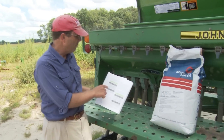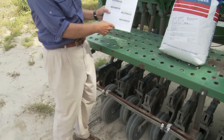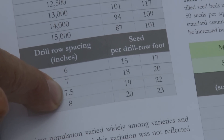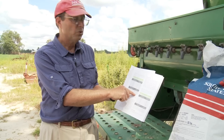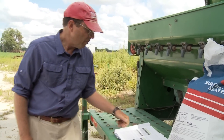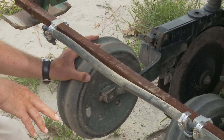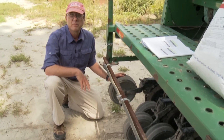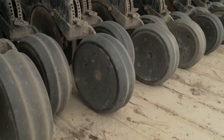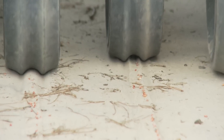To find the correct number of seeds per linear foot, go back to the Small Grain Production Guide table and check your manufacturer's row spacing. The row spacing on this drill is seven and a half inches. Looking up drill row spacing in the table, it says we want to be planting between 19 and 22 seeds per linear foot of row. To make the test easier, we've wired up the closing wheel so it doesn't close the row, reduced down pressure as low as possible, and picked a hard surface — a driveway, or hard-packed gravel — so seeds aren't buried and are easy to count.